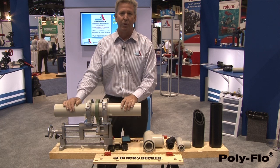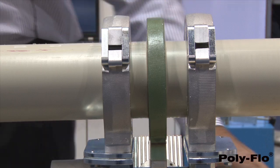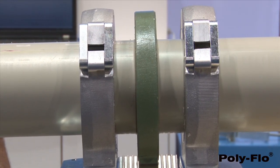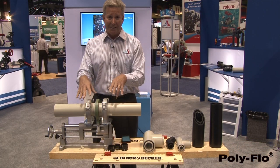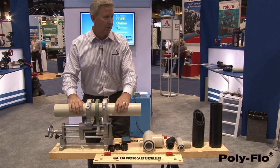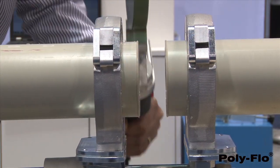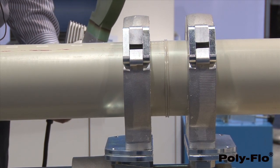We have a chemical chart that supports everything we're doing regarding chemical compatibility. We're about more than halfway through the heat soak now. This material is actually at a very important step — we're heat soaking into the material, allowing that material to be fused together. The joint is going to be curing and will stay in this tool for about six minutes for total cure time. You can take it out after about three minutes so long as you don't disturb it. Then we bring it up to that 60 pounds again — this gauge on the right-hand side is reading that.